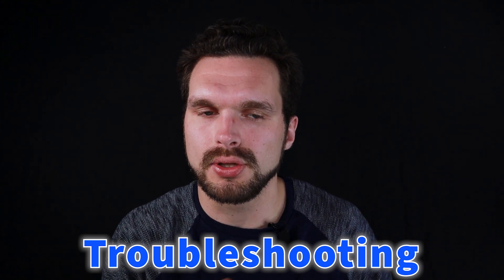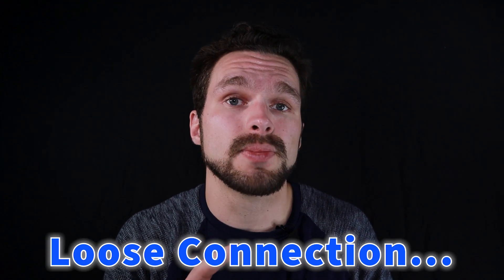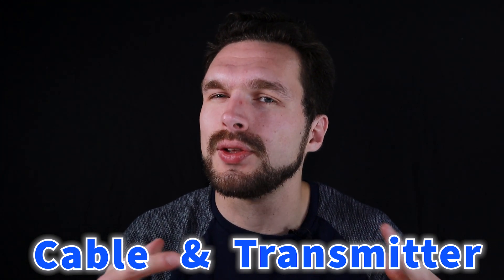Now with wireless audio technology, there has to be some trouble that gets involved. Maybe there's a loose connection, or maybe the wireless microphone falls off of a talent, or something goes wrong and the audio is doomed. You may come across a time where your wireless audio cuts out, or you hear some sort of humming or ringing noise in the back of the signal. Or perhaps your audio is cutting out because there's a loose connection between the TRRS end and your microphone jack — referring to the transmitter. This can happen considering the transmitter is hooked onto your talent, and they're going to be walking around, sitting down, with constant body movement. The connection with the microphone and the transmitter can gradually loosen over time, so it's very important to check the connection between the cable and the transmitter every so often.